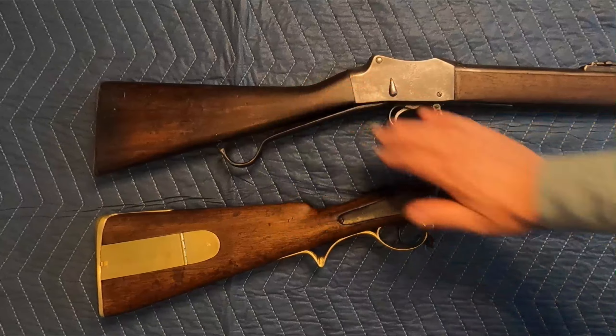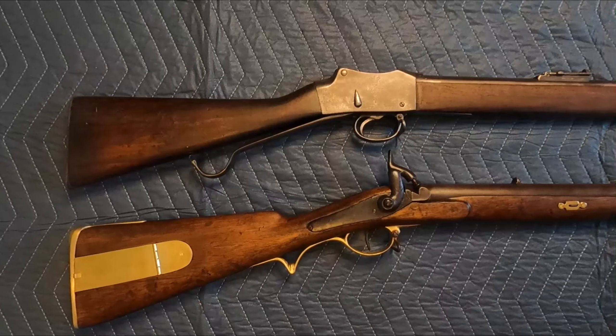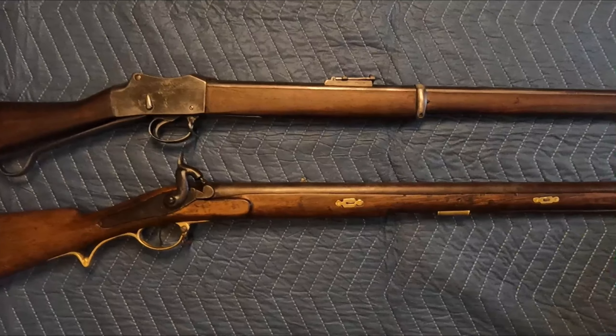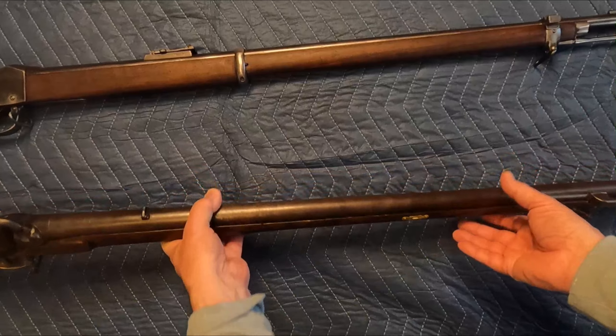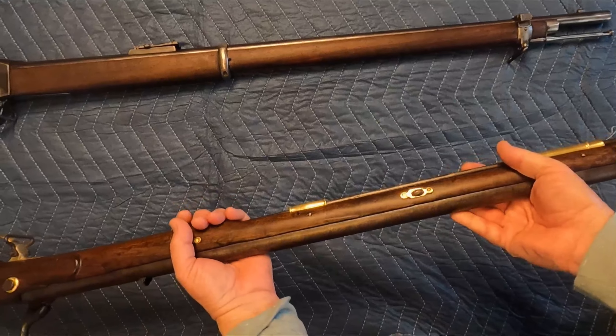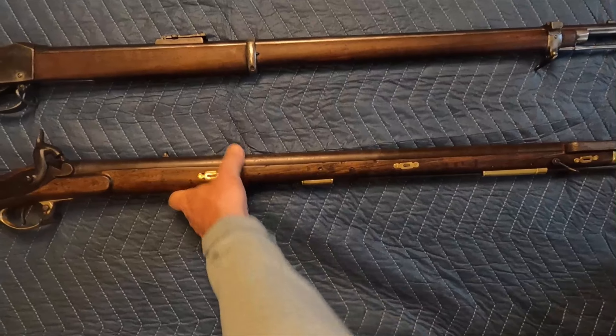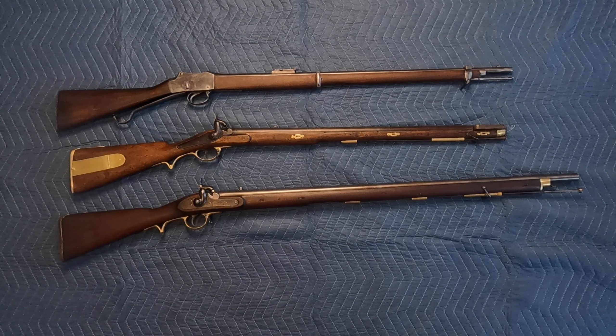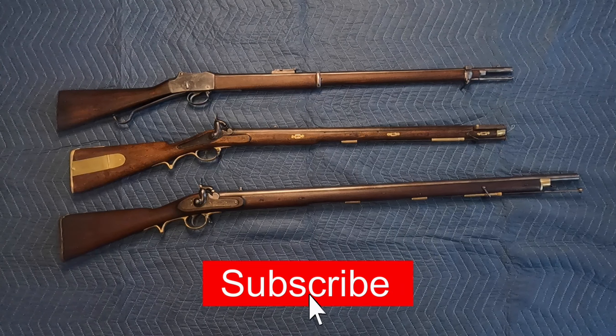Here's a Martini Henry and it's a pretty close match as far as the sheen of the wood and the stain. I fit in all the brass, the end cap, cleaned the metal up, got all the keepers in, and now it's a complete gun. The stain I used was Minwax English Chestnut number 233. The finish was a water-based polyurethane matte from Home Depot. I'm very happy with the way this rifle turned out. Thank you for watching the four-part video series on the rifle restoration — please like, subscribe, and share.